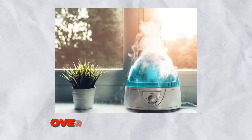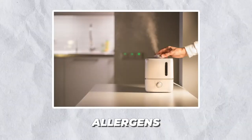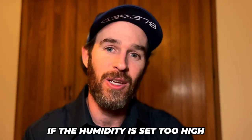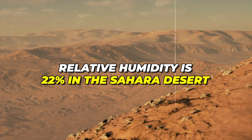The thing that most people don't know is that it is actually possible to over-humidify a space. While it is generally beneficial to have a certain level of humidity in your home, having too much humidity can lead to problems such as mold, allergens, or even wood damage to the windows and window frames, as water can condense on the windows if humidity is set too high. It is commonly recommended to set your humidity level somewhere between 30 and 35 percent. In Colorado, the natural humidity level can be as low as 18 percent — and for comparison, relative humidity in the Sahara Desert is 22 percent, meaning it's actually drier in Colorado than in the Sahara.